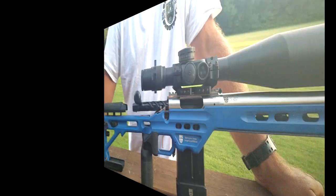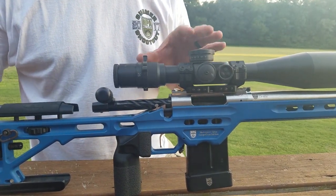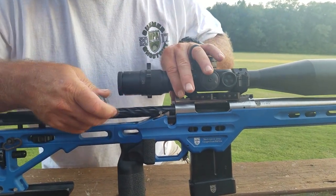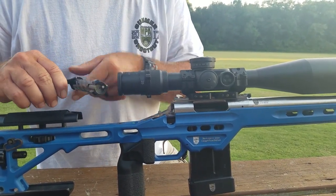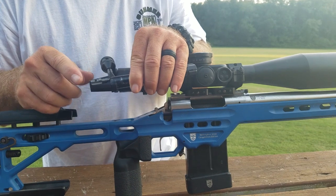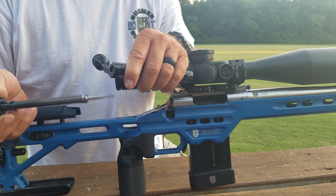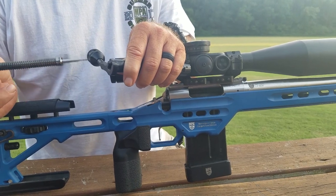Let's talk about the action first. The action is manufactured by Curtis Custom out of Texas and it's a wonderful action. It's built on a Remington 700 footprint. Some really nice features include a stainless steel action body, 4150 bolt design, heavy fluting on the bolt body, and the bolt and handle are all one piece. It's a three-lug design. You have an M16 style extractor, and a really neat feature is the ability to remove the firing pin and bolt shroud for cleaning and maintenance. To do so, you grab hold of the bolt shroud, rotate it, and basically the whole assembly comes out — giving you the ability to clean your firing pin assembly on the fly without tools, which is really beneficial in certain situations.